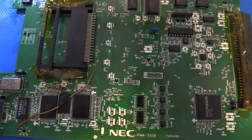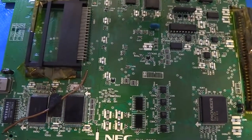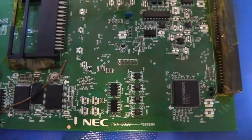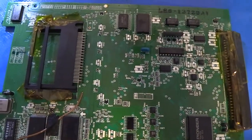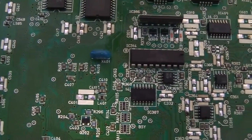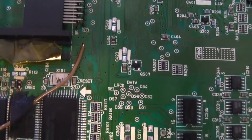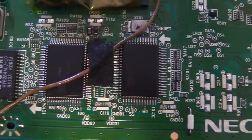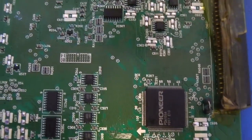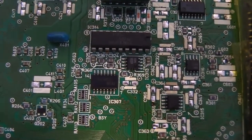it the wet toothbrush, with rubbing alcohol, where as you saw, we just kind of scrubbed everything down, lifted off all that surface electrolytic discoloration. And then after I gave everything a good scrub that way, I went back with a dry toothbrush and gave everything a kind of a buffing pass. And as you can see, it's just night and day difference. These pads are now looking really shiny, really clean. We are still going to clean all the pads up anyway before we apply new caps and new solder, but as far as just cleaning up what was there, it's just night and day.